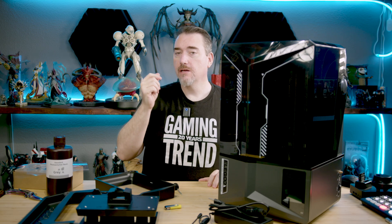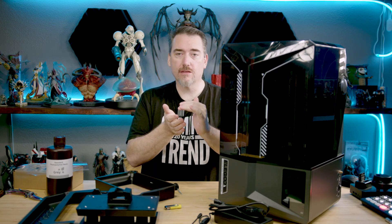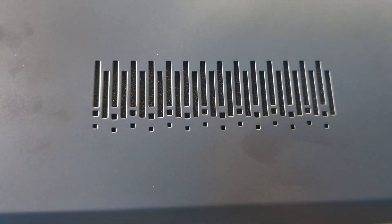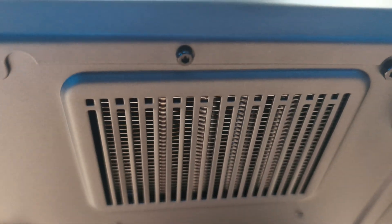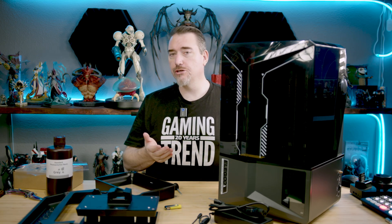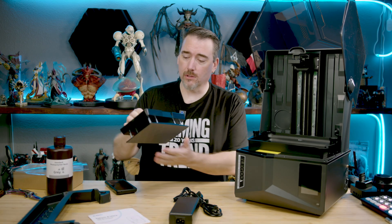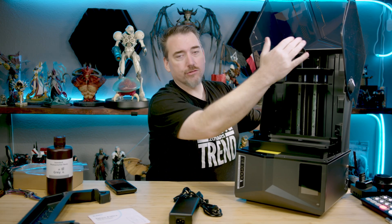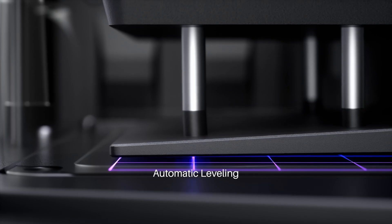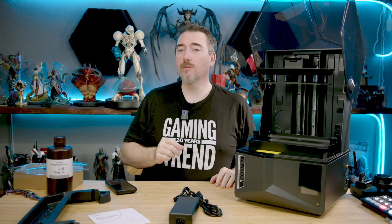We do see some differences in ventilation on the Saturn 4 Ultra versus the Saturn 3 Ultra. On the Saturn 3 Ultra, a small angled plate with fans underneath vented all air out the back. On the Saturn 4, there's a side ventilation system, a small vent underneath, and a port in the back. That back port is where you connect something like the Elegoo Mars Mate, which we'll cover in a different video — that plug has been present since the Saturn 2 and Mars 2, so it should be universally compatible. Installation of the plate is incredibly simple: the dog bone shape slides onto that portion and clamps shut. All the self-leveling function from the Saturn 4 Standard Edition is present here, so there's nothing more you need to do.